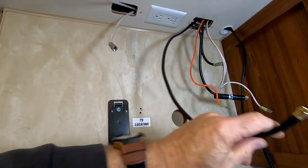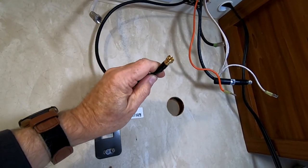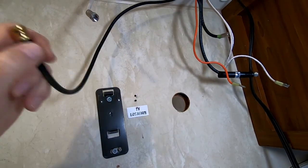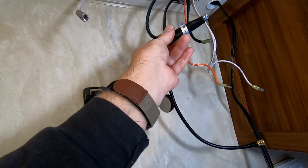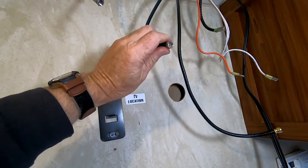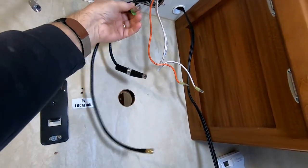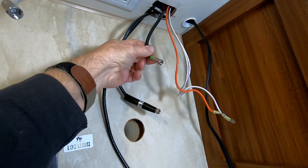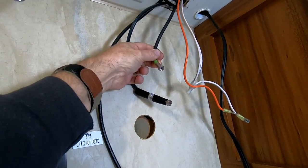Now we move on. This — I took it off the F connector on the inside of the power supply, labeled Set 2, but it doesn't go anywhere either. This end was connected, the other end is not connected, so I don't need to use that anymore. This one turns out was labeled correctly — labeled Antenna right there. It goes to the antenna on the roof of the travel trailer, and this end connects to the F connector on the printed circuit board labeled Antenna. There's one that's right. Now here's another one — this one also has a piece of green tape on it, and this is the one that goes to the connector on the outside of the travel trailer for cable TV. I'll be putting it on the F connector on the printed circuit board labeled Cable.